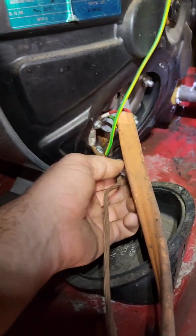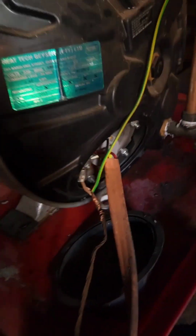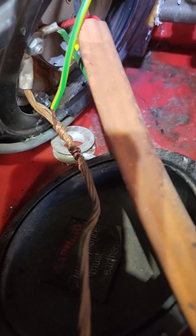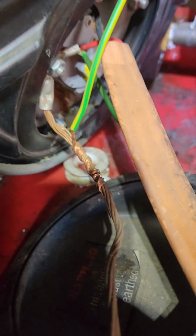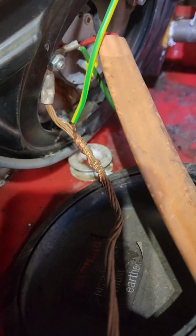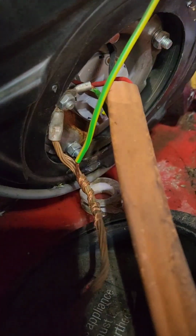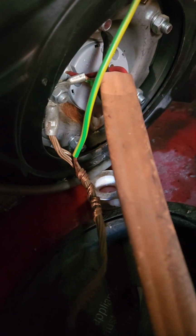And like I mentioned before about the bonding, this is not how you bond. If you want to properly bond, you put a clamp or a ferrule over that. This bonding is fine, it's tightened. You call this a bonding strap. So you see they bonded hot and cold water, and I've done this, but this is not done properly, so this will have to be fixed as well.